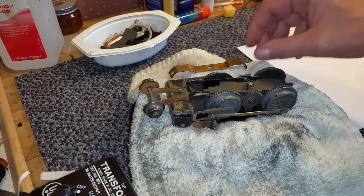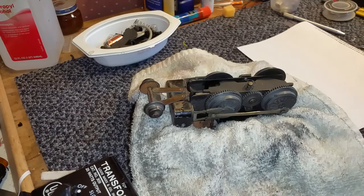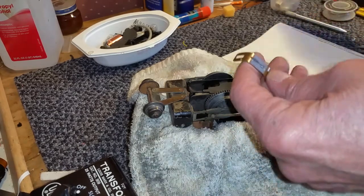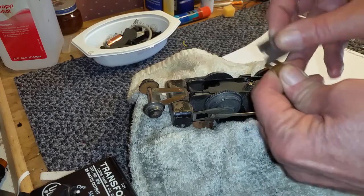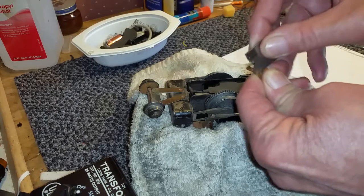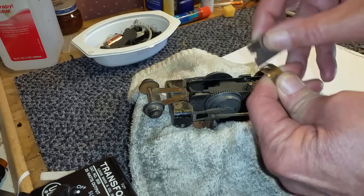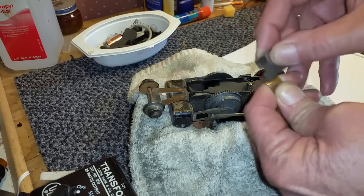To put this contactor on, you have to be careful that you don't break the plate off, but it's really simple to do. Before I install this, I want to clean off the copper so we can solder to it. I'm using a razor blade, as you see, and just getting all the oxide off of the contactor itself so the solder can stick to it.